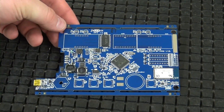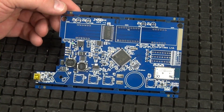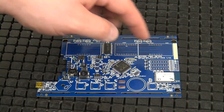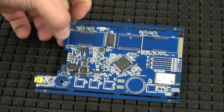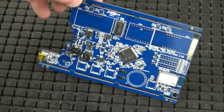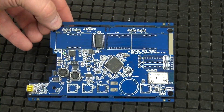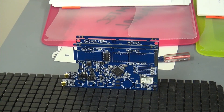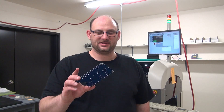So we've got our reflowed board here. We need to make sure everything looks okay visually — we notice there's no bridging, everything looks straight and even, there's no excess solder, at least none that I can immediately see. And then we put that in the back and keep on going. That there is a little bit about how the pick-and-place machine works. If you have any questions or comments, leave them in the comments section below. As always, like and subscribe, and until the next one, have a good one.